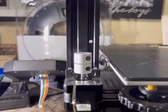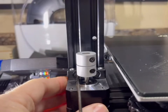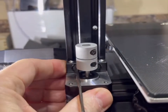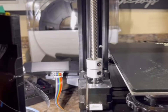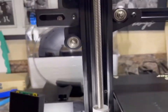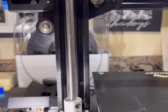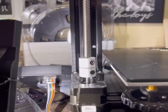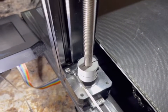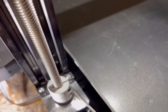We're going to take another look at alignment. The phone angle is off from what I see, but we need to move it just a hair — just a partial millimeter — to the right. Another way to check alignment before fully tightening is to put the drive screw in and eyeball it. This looks almost exactly centered up with the gantry, so once you've determined you're lined up properly you can continue tightening the countersunk bolts the rest of the way.